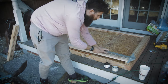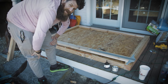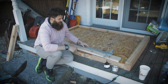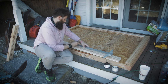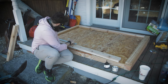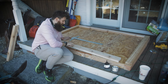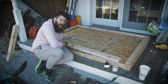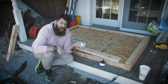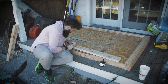Starting with the cup holder, I think eight inches on center in from the edge is good. For the first center token holder, I'm going to lay it out, then measure 24 inches to get an idea of where two feet off that is, and do the same from the other side. Those holes land almost on top of each other — about an inch apart — so right between them is going to be our center token slot. I'm going to take the three-inch hole saw and look straight down to make sure I'm centered over that hole.